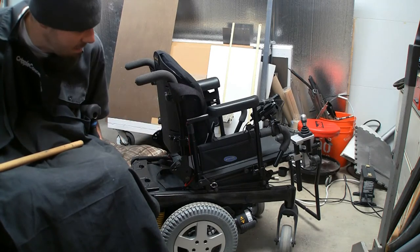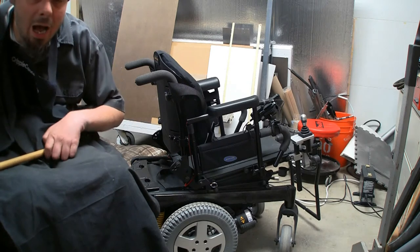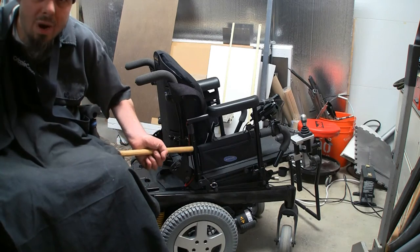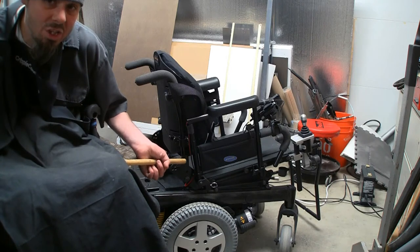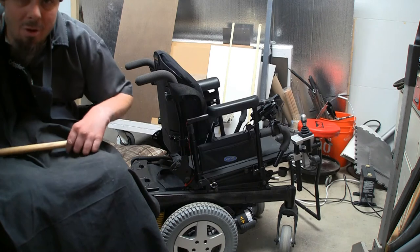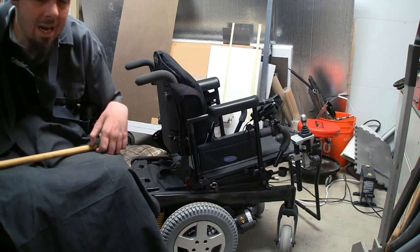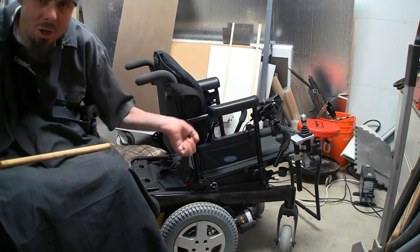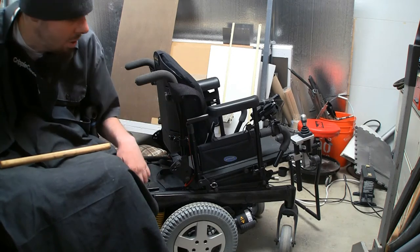Underneath it's a little complicated under the seat rest. You can see this red and black wire here — those are the wires to all the charge ports I added to the chair. Those tie into a box underneath where I tie them all together. I have a 15-amp circuit breaker and a 20-amp fuse in that, so the circuit breaker should pop before the fuse would.